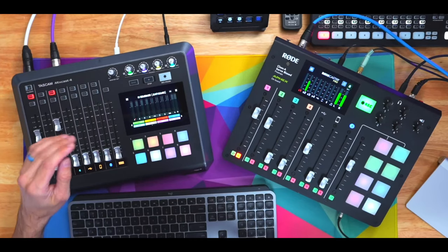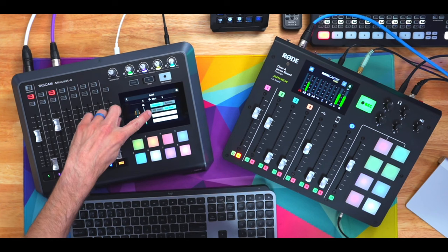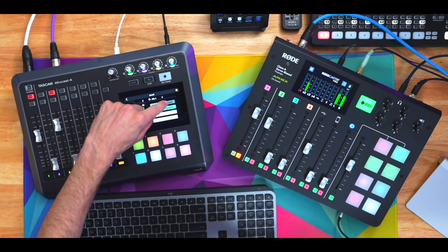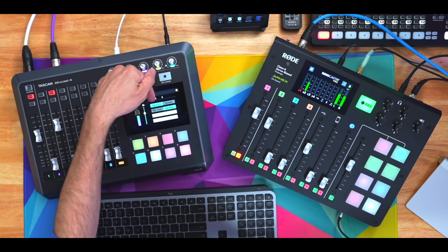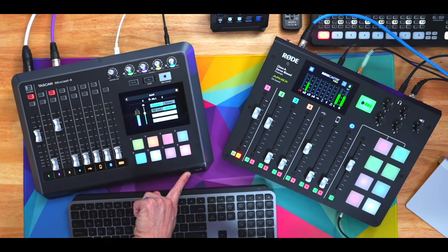a headset, like wired old school earbuds, remember these before AirPods? If you have something like this, you could connect this and actually use that mic, because it's actually kind of nifty and smart how they did this. You can go into your channel, and when you're adjusting your microphone, you probably can't see it because it's a little overexposed, but right here, you can choose condenser or dynamic microphone. And what that does is just turn phantom power on and off. But right below that, it says front or rear. So you can tell it if you have a condenser or a dynamic microphone plugged into a 3.5 millimeter jack in the front. I did try it with the VideoMic NTG. Did not sound good, but I think that's maybe more mic than they planned for.